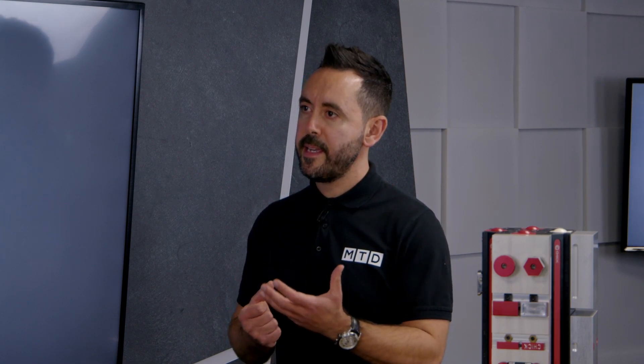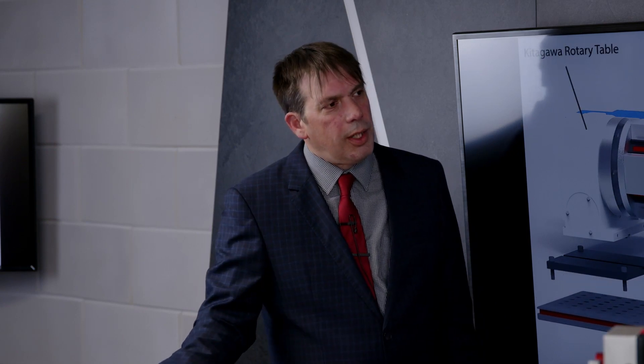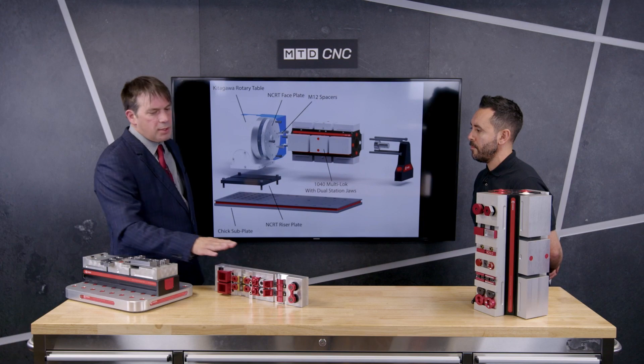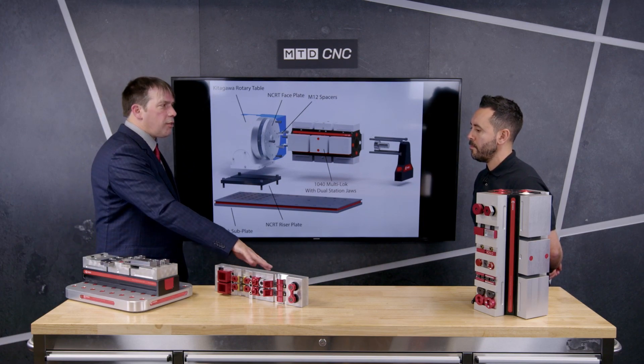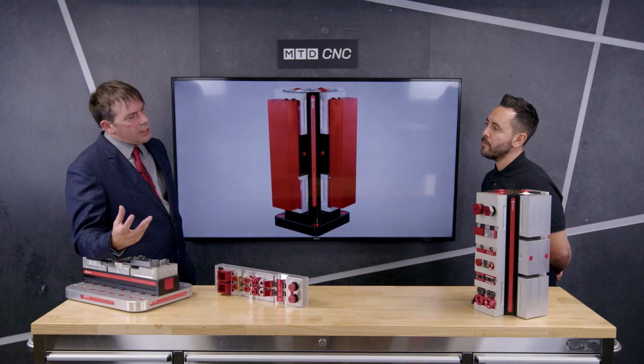The system offers better than 20 micron repeatability on the centre jaw — that's where you get your location from — and the same applies to the face plates. A round and diamond pin set underneath provides location without over-constraint. For clamping force, a key benefit of machinable workholding is achieving very high quality surface contact between the workholding and the workpiece. With no jaw deflection and no jaw lift, you don't actually need very high clamping forces, which is fantastic for thin-walled items or softer materials. And the more you envelop the workpiece in a machinable jaw, the more rigid and precisely it locates.